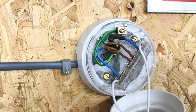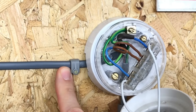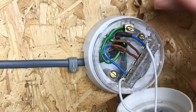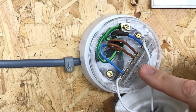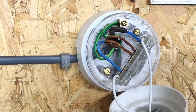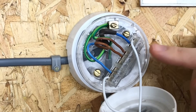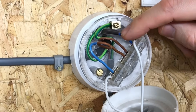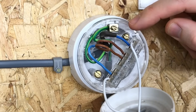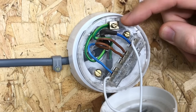At the last point on the lighting circuit there are some subtle differences. The cable has been brought from the previous light fitting but inside here some conductors are missing. The reason is we've reached the end of the circuit. The permanent live comes in and goes into the 'loop' terminal; the neutral comes in and goes into the neutral terminal — but we're not wiring another light fitting off this one, so there's no need to take another permanent line, neutral, and CPC out of the circuit.